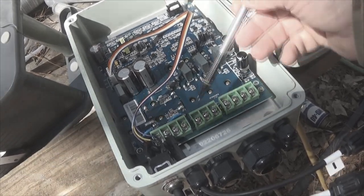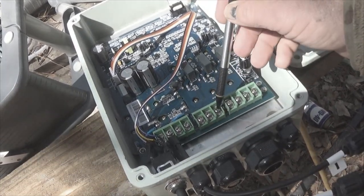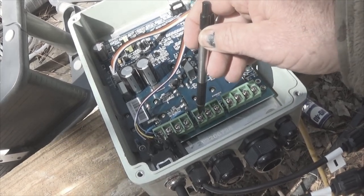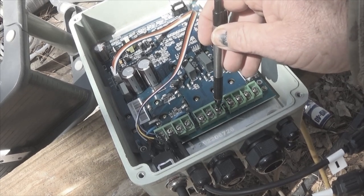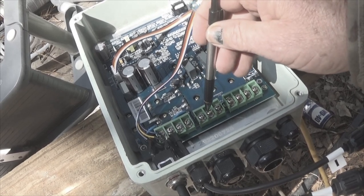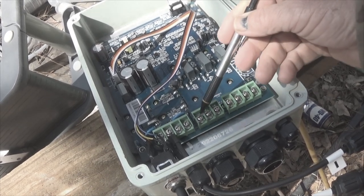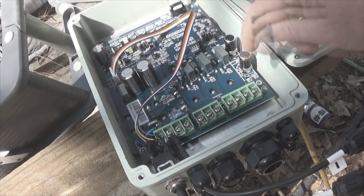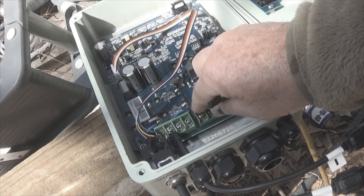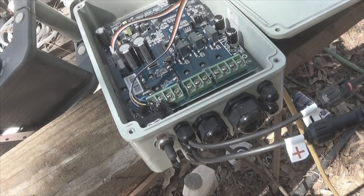The one thing to keep in mind, and this is important, wires 1, 2, and 3 have to be correct downhole for this thing to work. So if you're adding a 3-wire 12-gauge line onto this, make sure that you note what those colors are and use the appropriate tags that they give you so that they're labeled properly, or else the pump will not work. So that's real important. That's probably the most critical aspect to this, and we'll go into pump setup in just a moment. Dysfunctional Vet out.